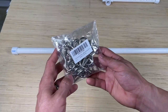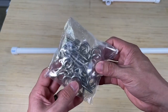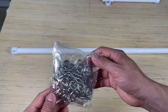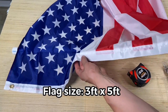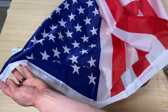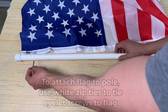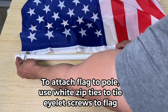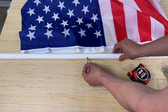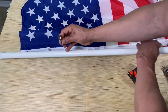So the flag is gonna be held up by these eyelet screws. I got these on Amazon. Everything I use, I'm going to link in the description of the video. Each flag needs 2 of these, one at the top and then one closer to the bottom so it can hold the flag upright. Next, we need to measure the distance between this hole right here and the top hole. In this situation, it is 32 inches. Therefore, we're going to put our eyelet screws right about here. So I'm gonna do it about 2 inches from the top, and then I'm gonna measure 32 inches down so I can put the second one there. Make sure you put them on the same side. So if you're gonna put it like this on the top, it needs to go just like that.